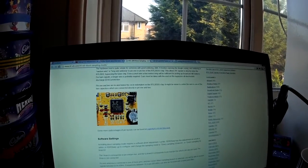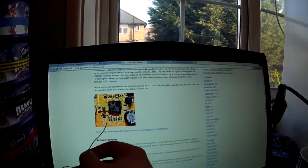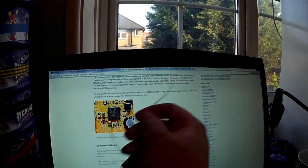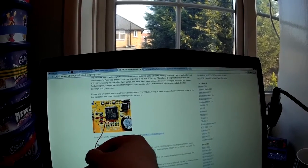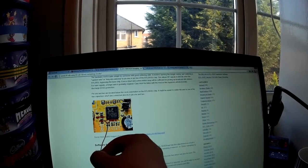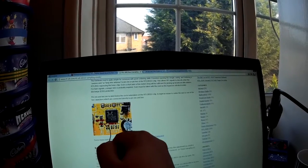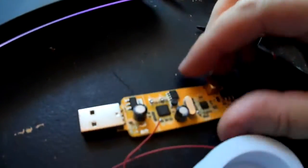All I did was, if you can imagine this solder being the mod wire, I've just placed it next to the pad to the side, placed heat with the soldering iron, with a little bit more solder on the tip, and what happened was it had a wicking effect. It seemed to pull the solder joint from here to there, so that this mod wire stuck well to the joint, and that gap is no longer bridged, should I say.